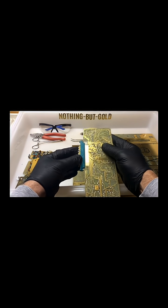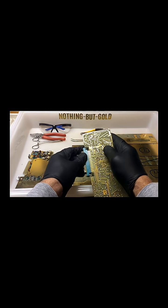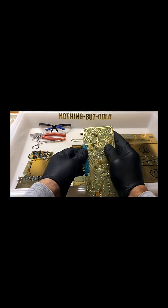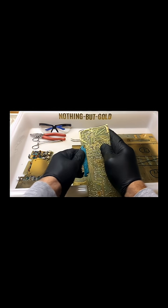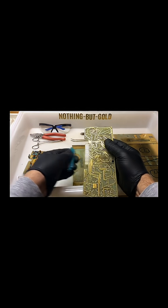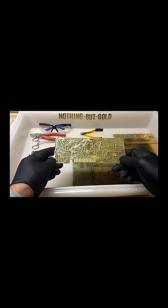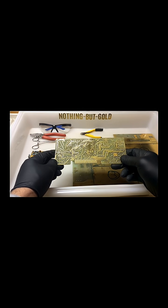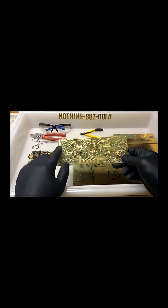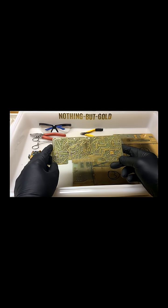Because if you take the connector, this board is designed to go in and out several times and still maintain electrical conductivity and resistance to corrosion. That makes sense. But what doesn't make sense to me is why Hewlett-Packard, in the 1970s, when gold was cheap, would change their process to put thick gold here and thin gold here. It just doesn't make sense with gold being so cheap.